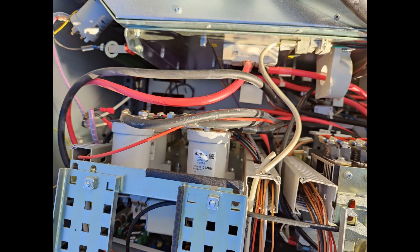After the choke it goes to the capacitor. On the left side of the picture we can see another contactor and a big resistor. This is the discharge resistor of the capacitor bank — when the unit is turned off, it discharges the capacitor so there is no voltage across the DC terminals of the connector which you connect to the EV.